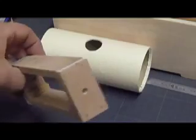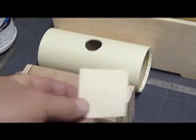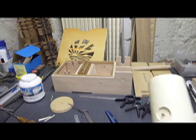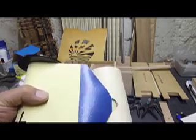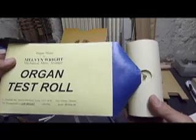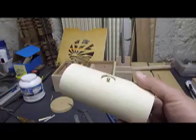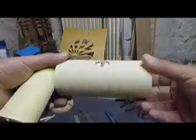There you can see the spool — the little frame that's going to go inside the small spool, which will run on the 6mm central bar. When I insert the wooden part, the screw hole will look a bit scruffy, so I've prepared a little bit of the same coloured card to glue on top before inserting it and putting in the screw. There is the finished spool with its screw, designed specially to catch the music roll on its little hook once the organ is ready to play. The main spool is now waiting for its ends and its central axle, and it will be ready to put in the pressure box. It took longer than I thought, but I'm pleased with the result — it looks more handsome than I'd initially thought I'd bother to make it.